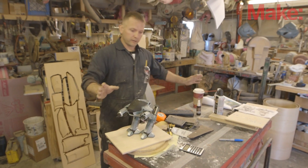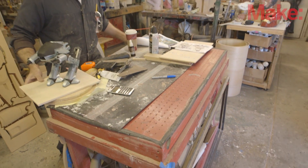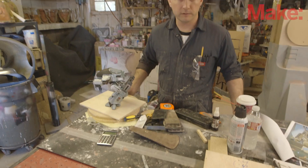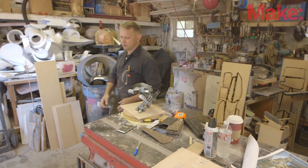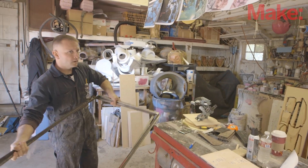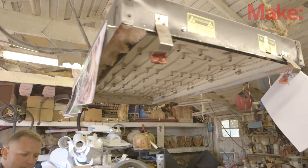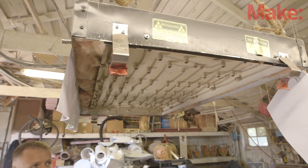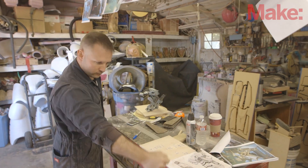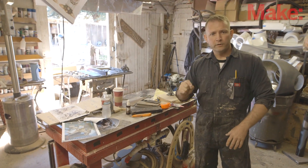In order to use this particular machine — which is currently in table mode — I remove all of the stuff from the top. You can see the surface there has a series of holes drilled in it; this is what you call the forming platen. What happens is I'll take whatever shapes I want, set them on top of the forming platen, and then clamp a sheet of plastic into this frame. The frame gets hooked up into my heating oven — you can actually see just the nichrome wire heating elements in there. Plug it into a 220 source and it gets very warm very quickly. Then once the sheet sags enough that I'm sure it'll stretch over the forms, I pull the sheet down, push it down over the forms, and engage the vacuum. It sucks out the last little bit of air at tremendously high pressure, and you end up getting all the really fine details on the forms.